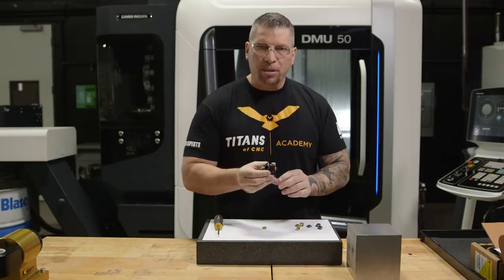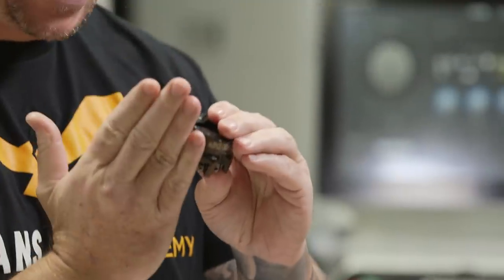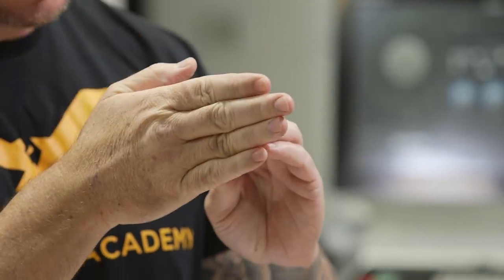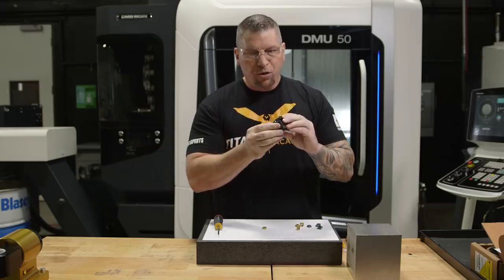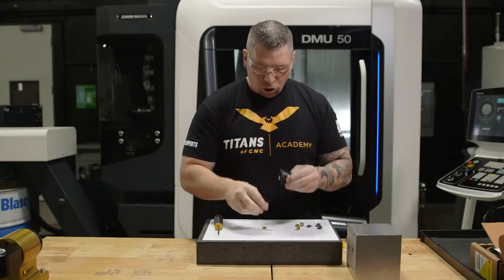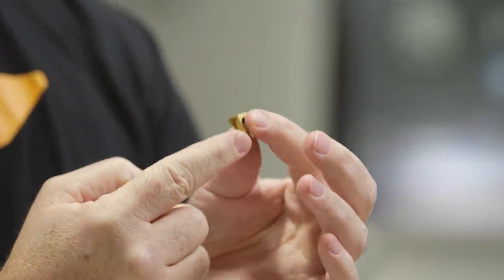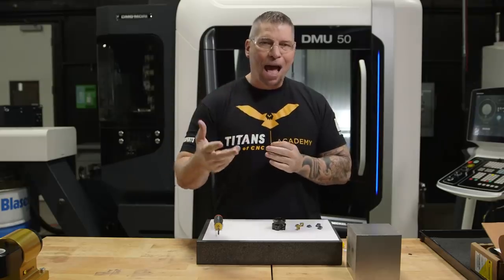These are shoulder mills. They're at a perfect 90, so you can actually step down and get that nice finish. Also, the Mill 4 means there are 4 cutting surfaces on each insert. The digits after the Mill 4 simply mean the depth of cut in millimeters, all right?